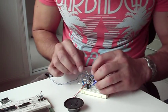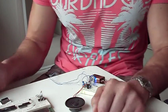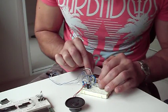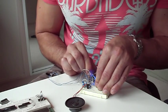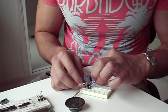I'll connect the speaker back up. There's the audio frequency oscillator, but not being gated. Now I'll break the connection of the two inputs connected together and run the low frequency oscillator into the second oscillator.